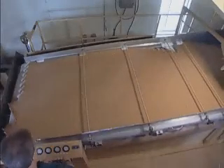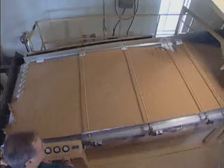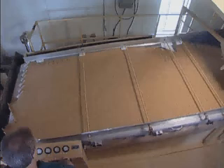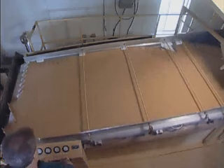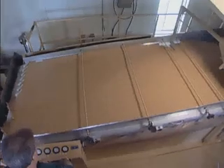The deck of your Oliver MaxiCap should be checked frequently and cleaned or repaired as needed. Dust can build up on the underside of the deck, which causes a restriction of airflow. Eventually, the deck will plug or blind completely. Your deck should be blown down with compressed air as necessary.